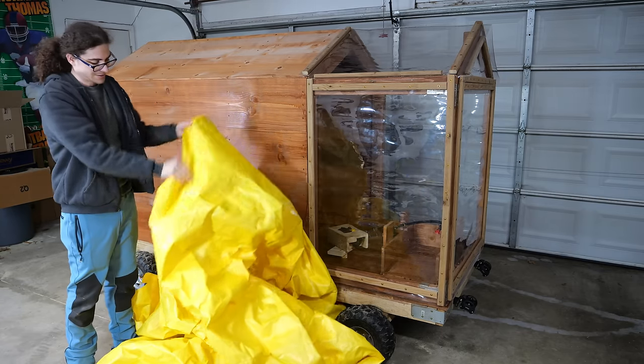With our door now fully complete, there's a section above the door that I've kind of been forgetting about. I was originally hoping that I'd have enough vinyl left over, but sadly I don't have a big enough piece, but I do have enough of the yellow tarp. So I am going to be using the yellow tarp as a makeshift window — I set up a little perimeter of the alien tape and stick it in place, followed by just a whole bunch of staples on top all the way around it. I decided against putting some cedar stripping around it just because I'm not sure if this is going to be my permanent solution. On the side of the door where the hinges are, there's actually quite a big gap which isn't something I want. So I take some of this window rubber sealer and I place it along the inside of the seams, both on the frame and the door itself. It has an adhesive back so you just cut it to length and you push it on. So now when I close the door, we can see it's completely filled up by the window seal insulation — no rain or snow is going to be getting in there.